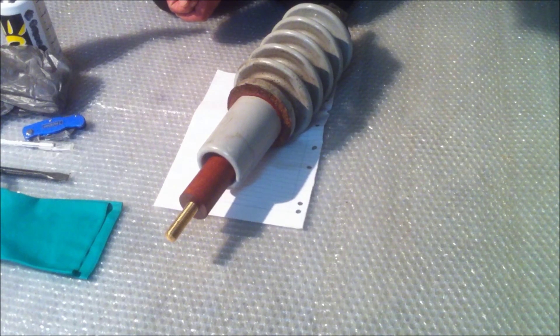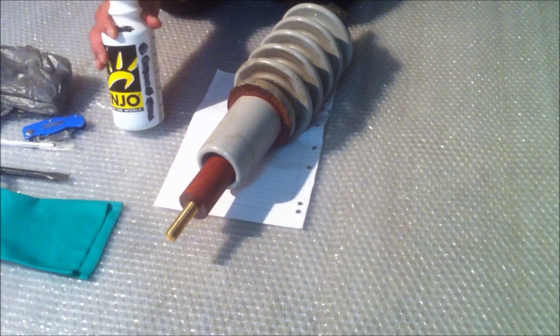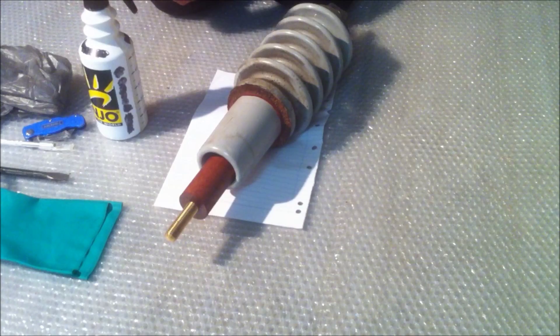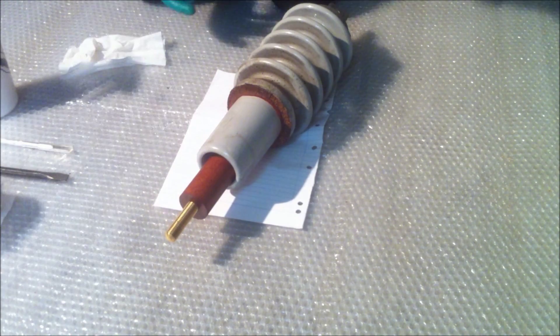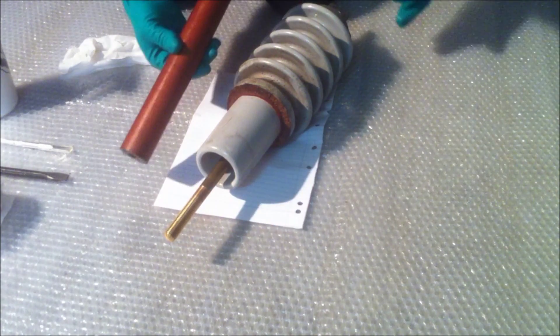Another important component of removing potentially hazardous gaskets that have got asbestos in them is to use water as a wetting agent, preferably with a bit of detergent in there. It will help absorb into the gasket and should minimize the amount of fibers. You don't want to be hacking at this thing and creating little bits and pieces everywhere. We want this gasket to come off in the least amount of pieces to minimize asbestos fibers in the air. We're also going to need a respirator with asbestos filters, so I'll go and put all the safety gear on and we'll start cleaning.